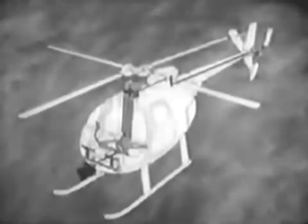The aircraft has been specifically designed to avoid the need for boost or automatic stabilization equipment. The flight control system consists of simple bell cranks and push-pull tubes. No lubrication is required on any of the joints or bearings in the entire flight control system.